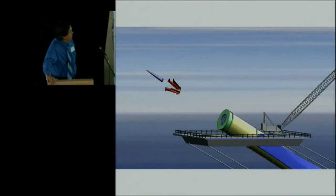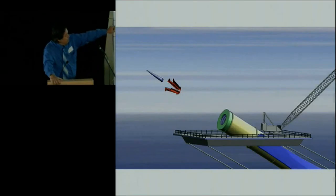This shows the business end of the system. That's basically a three-meter diameter tube at the muffler end. What's not shown internally is a classic silencer where you capture the gas - unlike TV silencers, we want to capture all the hydrogen we can because we want to recycle it every shot. We have built things like this that have recovered 97% of the hydrogen, no problem. It's easy to build a muffler that can capture the hydrogen - we've done it ourselves.